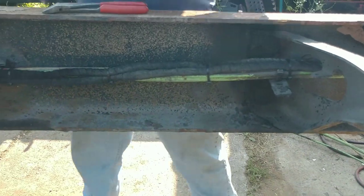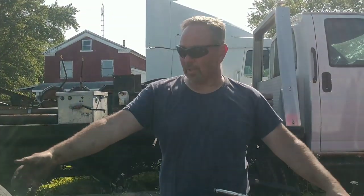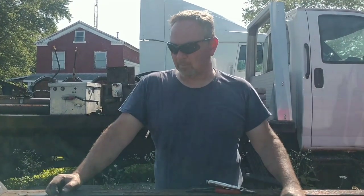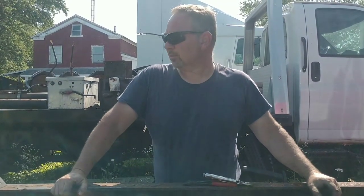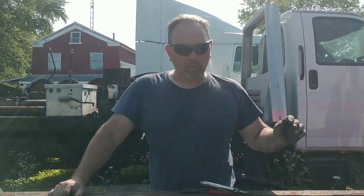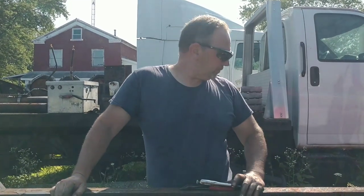Okay, that's it. We're done. We're waiting for the drive shaft. The drive shaft's been dropped off. I pulled the front drive shaft out, taking the rear drive shaft, they're lengthening it by about, I think it ended up being 6 inches, I figured. Once they lengthen it, they'll put it together as one unit, put it on the machine and balance it as a complete unit, both pieces of drive shaft together. Once we get that, we'll put it in and we're done. So we'll bring it back.